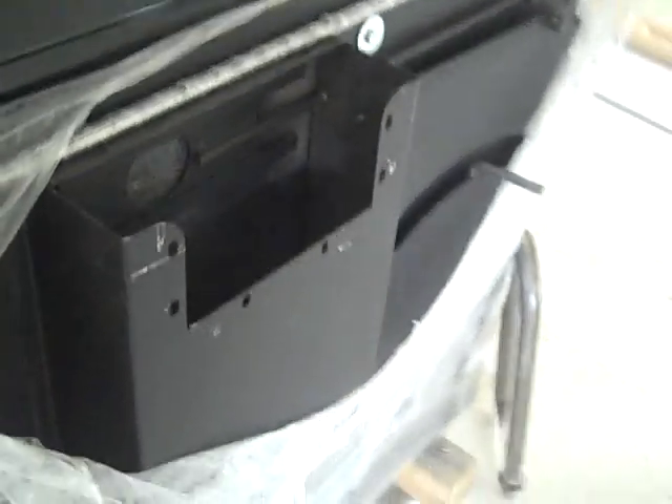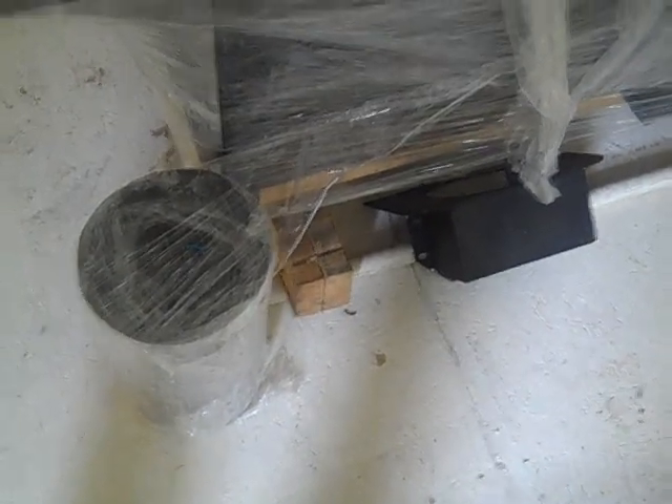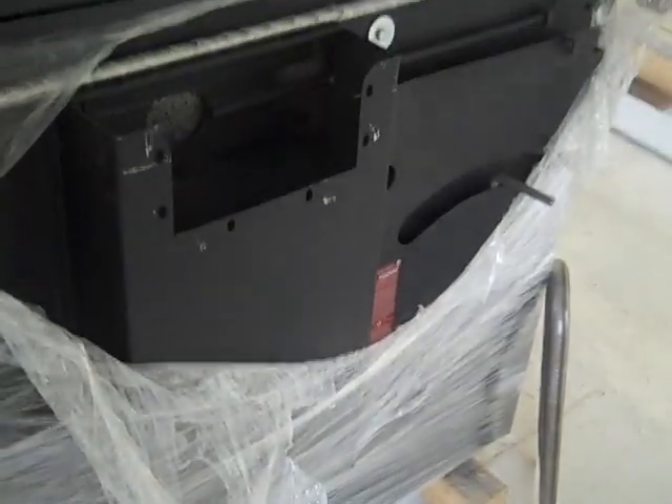We're going to go straight up with a stainless steel stove pipe. They all come with a 7-inch — 7-inch used to kind of be the standard. So we have a 7-to-8-inch transition, and then we'll switch to a double wall insulated stove pipe.